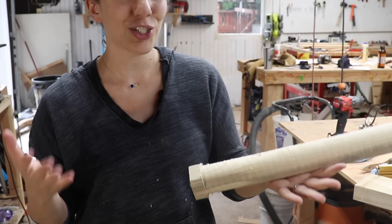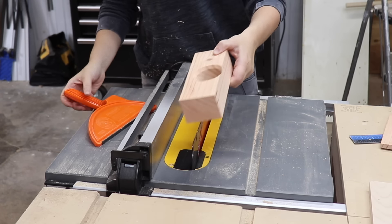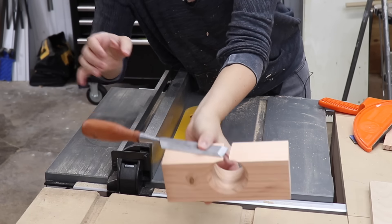Now I just want to try one more method — the old school way with just using a hole and a chisel. I want a little opening on top so I can lay a chisel on top and it will slice into the wood and turn it into a dowel. Before I can put a piece of wood in here I just need to shave off the ends like a pencil so it will go into the hole. I ended up doing that with the belt sander — it was a lot easier. Now I just need to clamp everything down with the chisels slightly skewed into the opening on top of the hole.